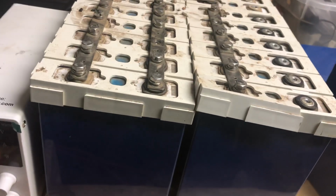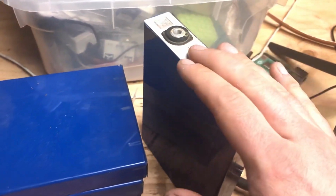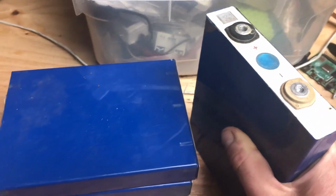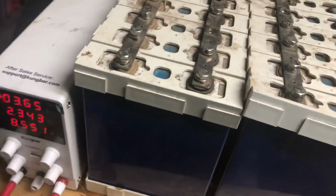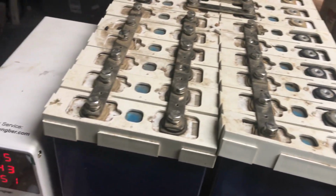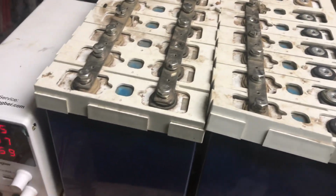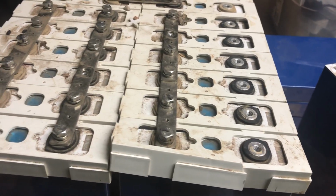They are superior to lithium ion. I mentioned that this would not be anywhere near 3.2 and would probably be dead in the world of lithium ion, and most certainly would be dead in the world of lead acid. So in 10 years or 15 years, or even perhaps 20 or 30 years, I've heard that there's nickel cadmium type of chemistries that have been known to last for decades. You really want to consider the long-term usage of those batteries beside the initial cost.